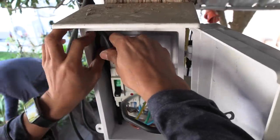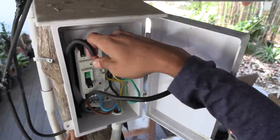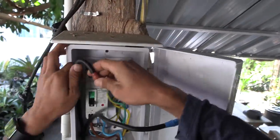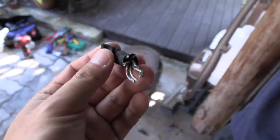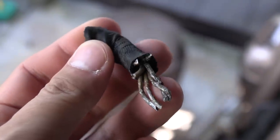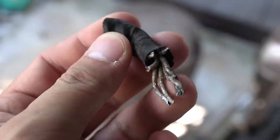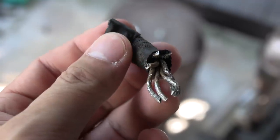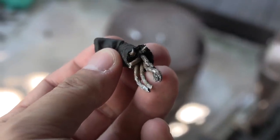This is the way it should be done. In Norway we call it a 'cable shoe' — I'm not sure what it's called in English — but this ensures the best connection and all the wires are in use. Compare this to the old shabby connector done by the local guy, where not all wires were connected. The few wires that were in use became a bottleneck and overloaded, which is why it overheated.